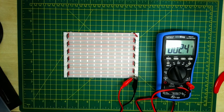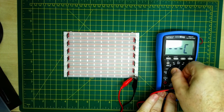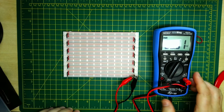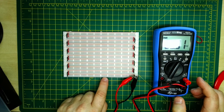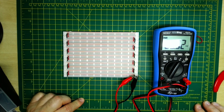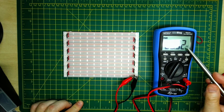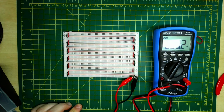While we have it wired up like this, I've switched to the capacitance meter to look at the parasitic capacitance on these boards. Because we've got the capacitance of each line effectively in parallel, when you add capacitors in parallel you get the sum of their capacitances — unlike resistance, where you get less. What we can see here is 0.32 nanofarads, so that's 320 picofarads. That works out to approximately 20–25 picofarads per power strip — certainly something worthwhile bearing in mind.